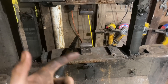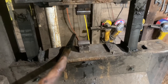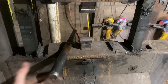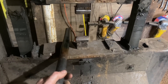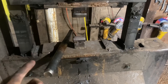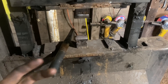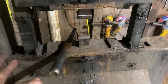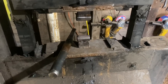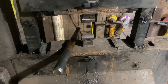So next step is forging out the cheeks. I want cheeks that are about two and a half inches tall. Here is where you really got to move. You got to bang the drift in out of the swage block, run in here and get this guy into these cheeks spreading fuller. The reason you really got to move is because the drift acts as a heat sink and pulls the heat out of the billet. As the cheeks get thinner and thinner, you have less and less time to work. You really don't want this drift in that billet more than 30 seconds or so. So like I said, you really got to move. If it cools down enough to get stuck on the drift, God help you.